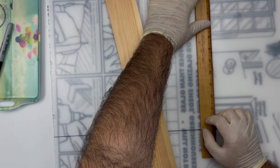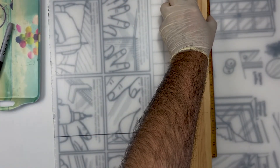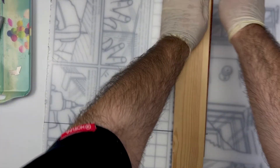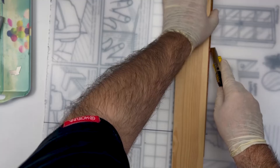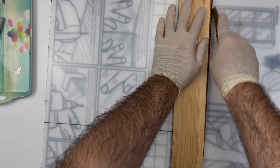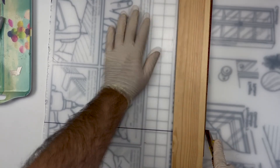After tracing out the side panel outline I will use the least elegant cutting method by scoring the piece of acrylic with my knife. A better way of doing this is using a slow metal saw as it creates a far better edge, or if you really want to go for it then a hot wire will be best. The reason I went for scoring and breaking is because I don't want to create a lot of debris in my little office. I will be moving soon and in the new place I will have a better shed where I will be able to do these things properly.